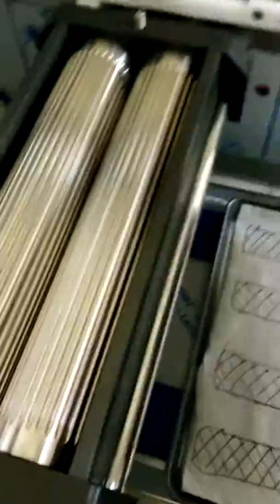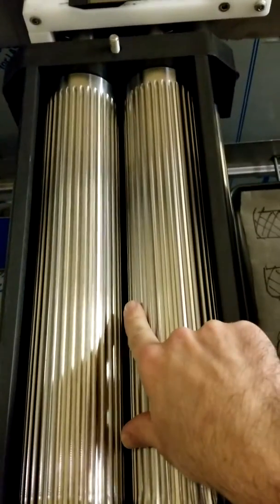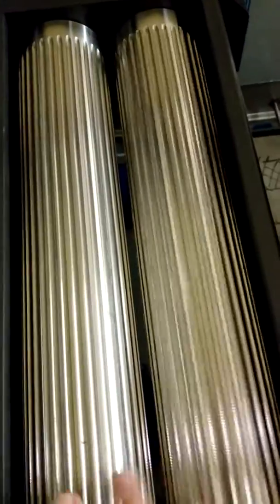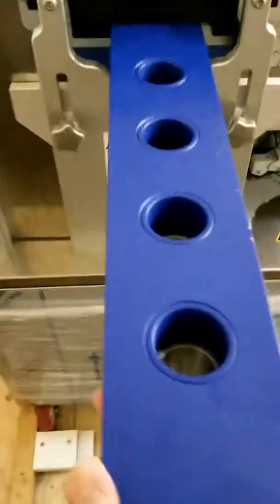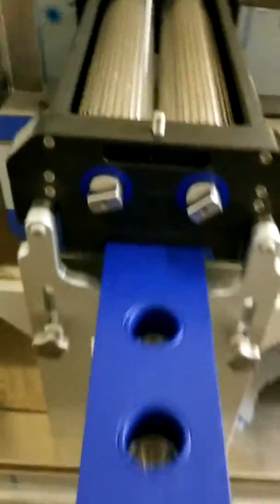You have this stainless steel hopper on top and two rollers inside. I'm going to take off this cover so you can see a little better. Basically the dough will go inside of that stainless steel hopper and these rollers are what extrudes the dough. The dough sits on top here, the rollers spin simultaneously inward to press the dough down through, and the tray would be right underneath. This is the template that sits just below the hopper where the product will pass through.